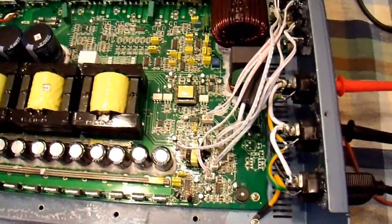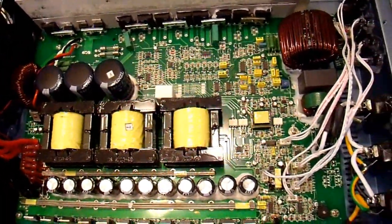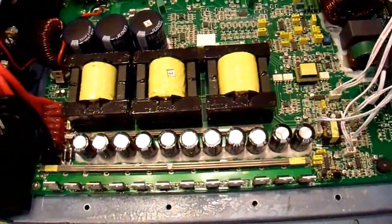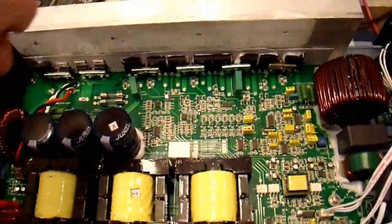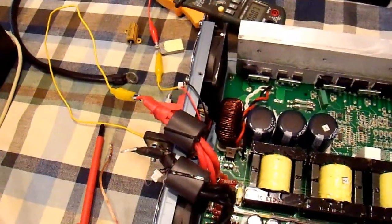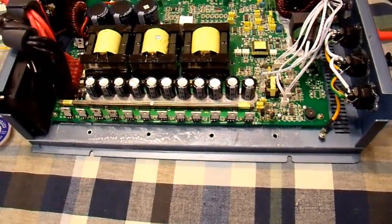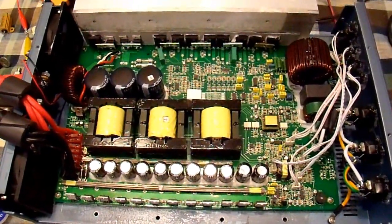I think I will set this project aside for the rest of the day and just pretend like everything works fine. But I do have to reassemble it all. I also fixed some of these heat sinks, which were bent up pretty badly during the install — which is likely why this one failed in the first place. I have to add heat sink compound to all of these, put the heat sinks back on, bolt it all back up — plus the auxiliary ones — hook up a real battery to it, and do some sort of stress test to make sure this thing actually works. I'm still kind of skeptical; after all the problems, I wouldn't be surprised if I found some more. But for the moment, I'm going to be optimistic. I'll let you know pretty quickly whether this works or not.